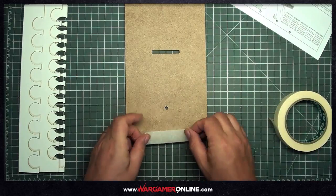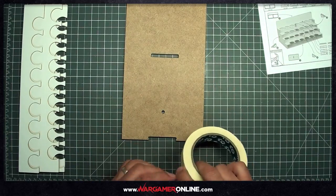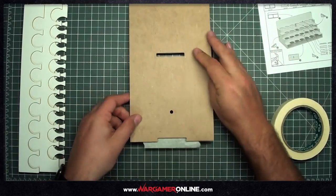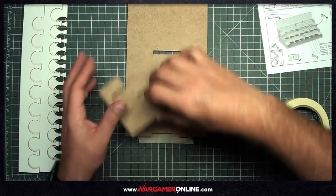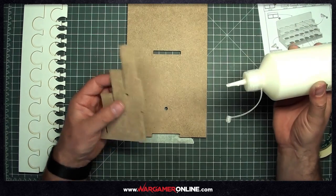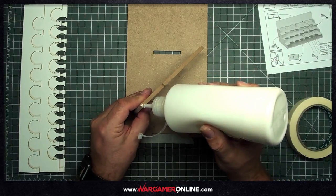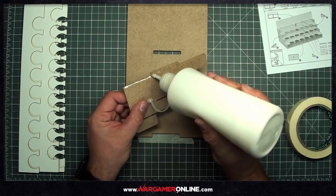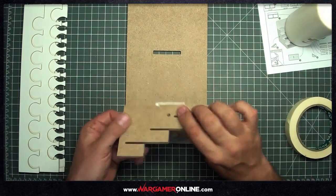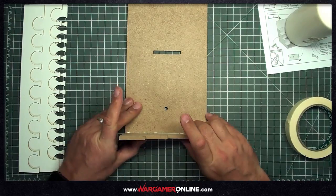We're going to start by securing a couple of pieces first. I'll give myself a little bit of masking tape at the end of each of these. The materials you need are basically tape and wood glue — there's no need for screws, nails, or anything else. If you use masking tape just to hold everything into place, that should secure things sufficiently while it glues. I'm using a wood glue here — any solid PVA-based wood glue is ideal. I'll apply it to the bottom and the side to get both surfaces, then grab the overlap of masking tape and tuck it in.